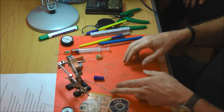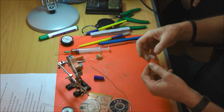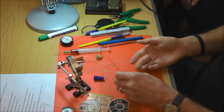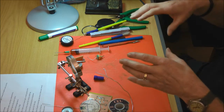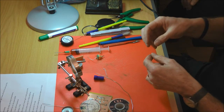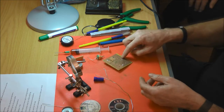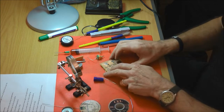The whole thing we were talking about earlier with oxidisation: has anyone ever made lead fishing weights or anything where you melt lead down and you get a beautiful mercury finish, you scrape the dross off and it's a beautiful mirror-like finish, but within seconds it's oxidised. It's the same with any solder, it's oxidising all the time. So the flux is keeping the oxide on the skin away from the actual joint, from contaminating it. You want it to be active when you're soldering, and not to have disappeared and been burnt off. So it's a protective barrier to stop the oxidisation. Yeah, it helps on the actual material you're working on, and the solder, as it melts and fuses, I say fuses, adheres to the board.